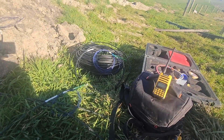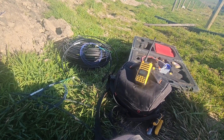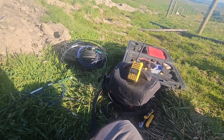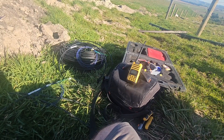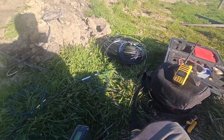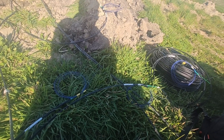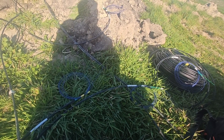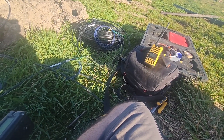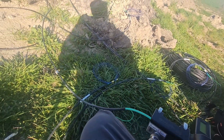475 meters down to the bottom end. I like to just get a little bit to stick out the other end so it's good enough to work with for splicing, or if I want to extend the duct on the building. It does slow down quite a bit once you pass 200 meters, so I'm not really pushing it very hard.